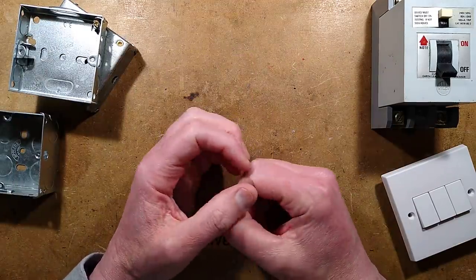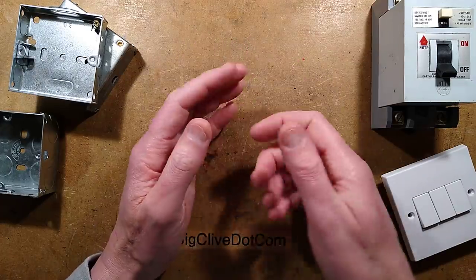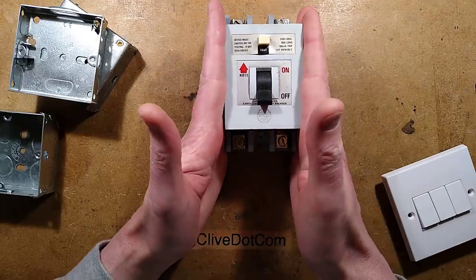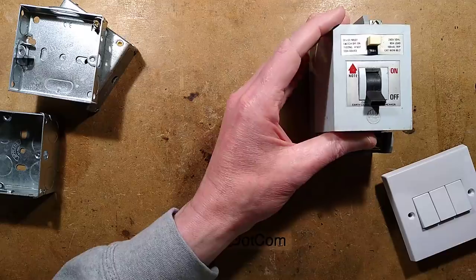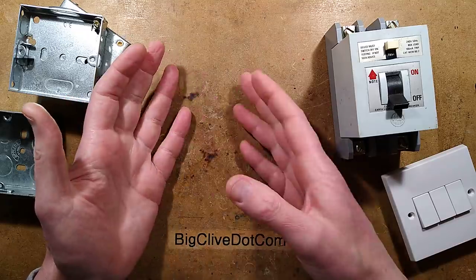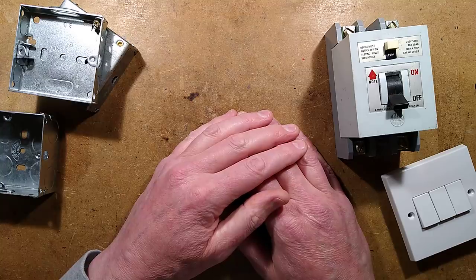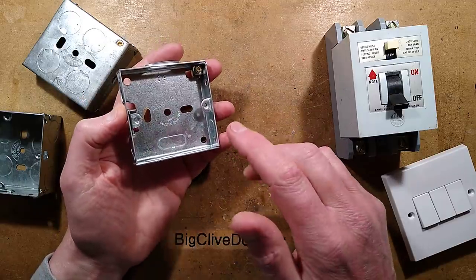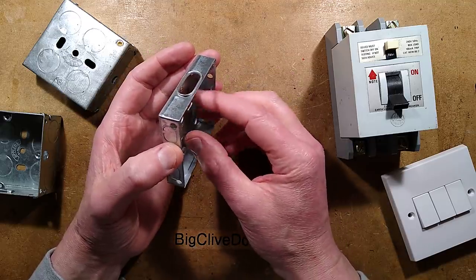Normally, live to earth makes quite a bang and blows the fuse decisively. When I put a new fuse in it would also blow. I put the other fuse in, clamped it, and it was showing eight amps in that circuit. I did not realize at that point this RCD wasn't working — everything was just lining up. So I went on this hunt for what looked to me like a live-to-neutral fault passing lots of current.